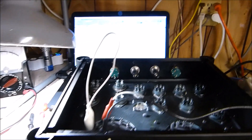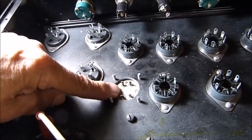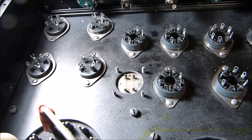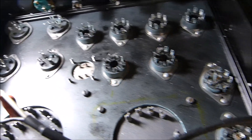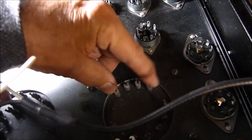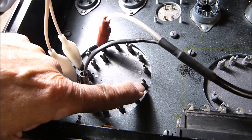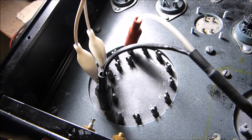That little cathode choke measures about 315 Henrys. I won't go through all the measurements, but I wanted to do this before I built it so I'm not troubleshooting blind later. This LS-58 driver transformer also measures around 300 Henrys because it has a 50k ohm primary. This is a center-tapped push-pull grid winding — ground in the center, with strapped taps giving you many secondary impedance values. It provides an enormous range of output impedances.